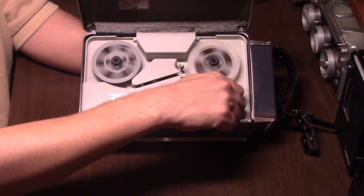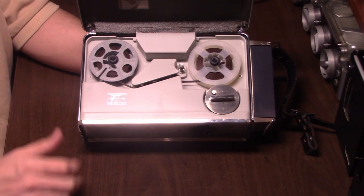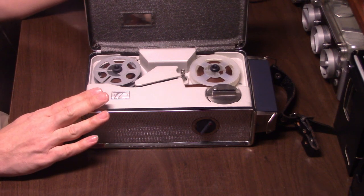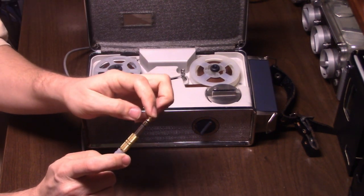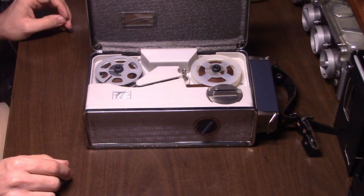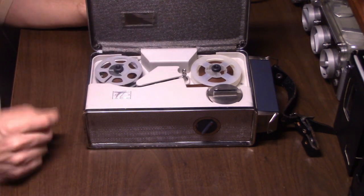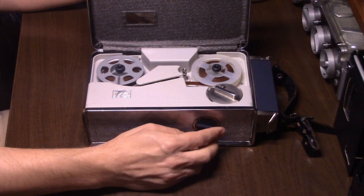The recorder is operating. When I first tried it out I had to hook up external power. I made an educated guess that it was positive ground, considering it would be using Germanium PNP transistors — which it does. Chassis ground is positive. You can use a quarter-inch jack where the tip is negative and the ring is positive, and supply 10.5 volts — that's the operating voltage it's designed for, since it uses seven AA batteries. I've got a 9-volt in here instead because I don't have the battery holder, and the amplifier won't perform at maximum performance on 9 volts, though motor speed is still correct.